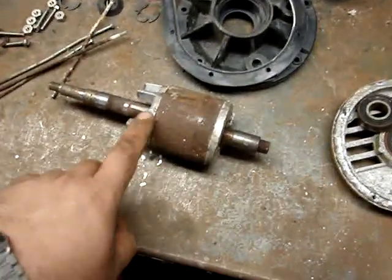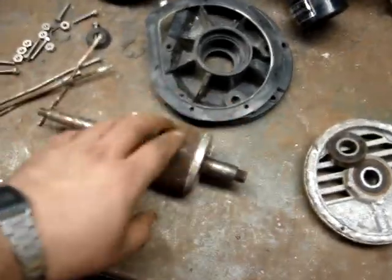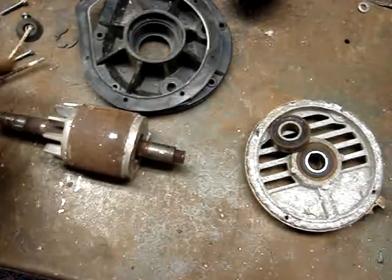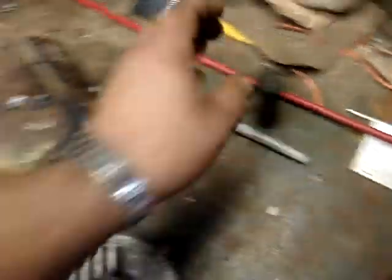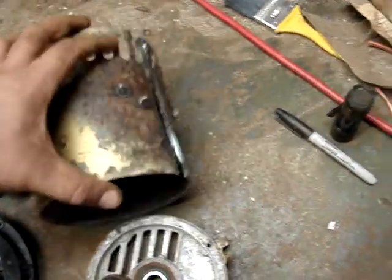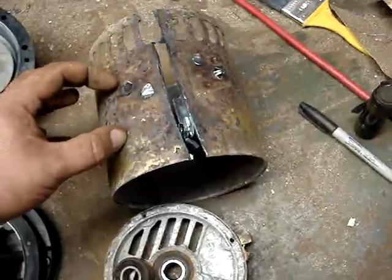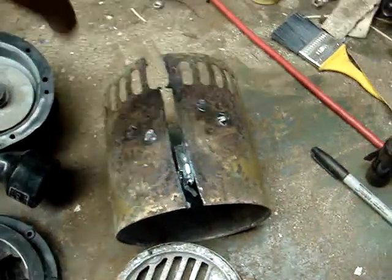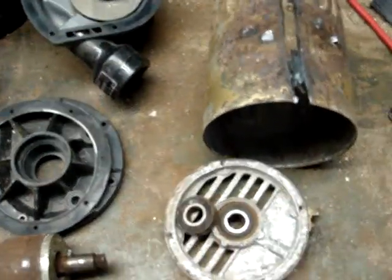What I plan to do is get the shaft here out from the middle, pry these out or whatever, and get this shaft clean — I don't want the center part of the motor on there anymore. Then I'm going to re-weld this together, cut a slot out of the center part, and mount a pulley on here so that I can run the belt out through the center. I'll still have my two bearings on the pump shaft, because the pump itself has no bearings in it. That way the pump will all go back together and I'll be able to belt-drive the pump.